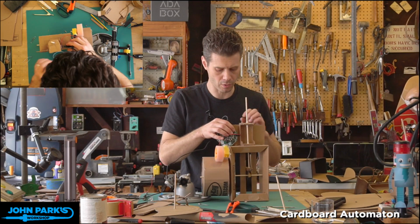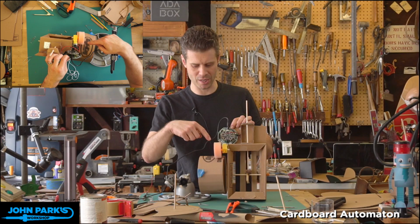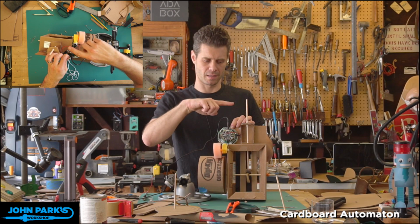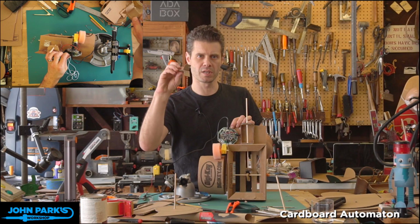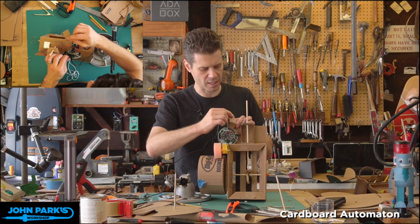So now what I'll do is run it. And you can see I get a little slightly bouncy TT motor here, but it turns the wheel very nicely. And look at that great motion we get on the shaft here. Now what I had done earlier is I had attached just a little piece of cardboard, ran a hole through it, and put it on this dowel so that with the up and down motion, we could attach something to the front of that. So let me stop the motor for a second. I had put it inside the middle here, but let's put it on the very top just so I don't have to pull that shaft back out.